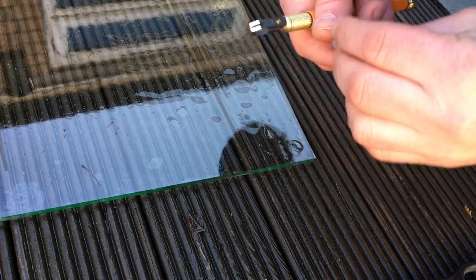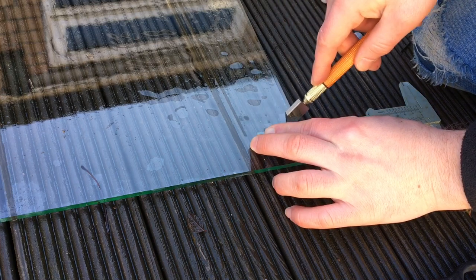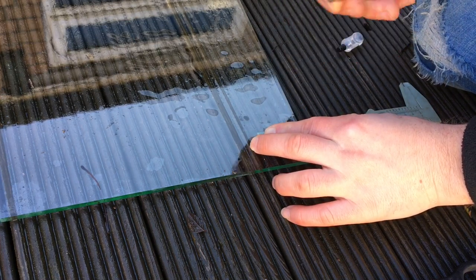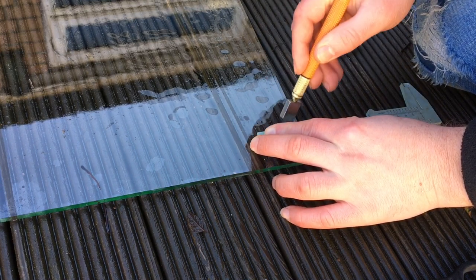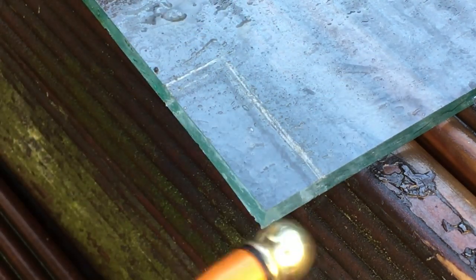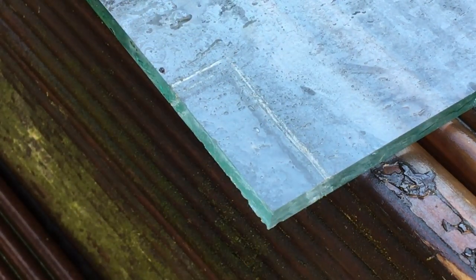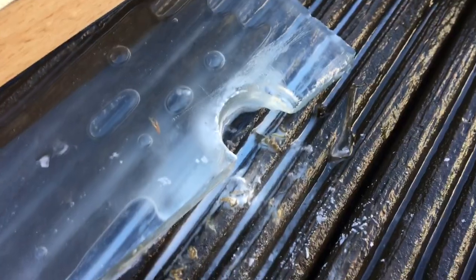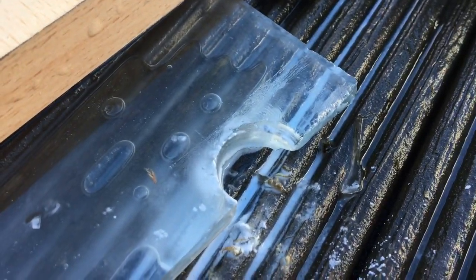I tried to cut a corner off using a glass scorer but just couldn't get it to work. I lubed it up with glass cutting oil, used a ruler to make straight lines, and scratched it fairly deep, but I couldn't get a good purchase on it. I think it's because the glass was too thick — this glass is 6mm. The scorer should have been able to cut through it according to its description, but it just didn't work. So in the end I used a glass drill bit to drill the corner out. After ages of trying to get the scratch to crack, it didn't crack, but I managed to drill the hole. I think drilling is the best way to do it.